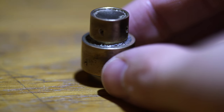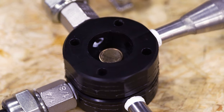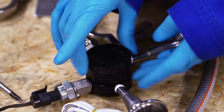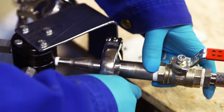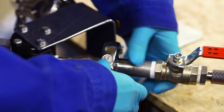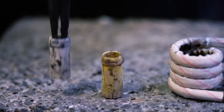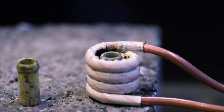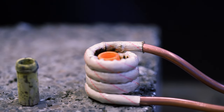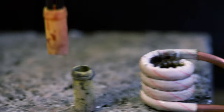We got a couple of swirl injectors soldered well enough to put them to a preliminary test in our little water test stand, just to investigate the spray pattern, throw properties, and how these swirlers actually behave. Then we did a quick and dirty thing — we just took a piece of six millimeter copper pipe, rolled it up, and made an induction coil for the same induction heater we're using for melting different bits in our casting experiments.